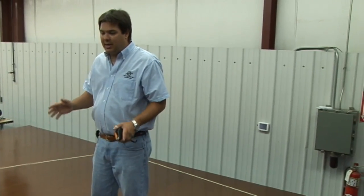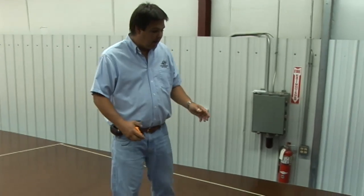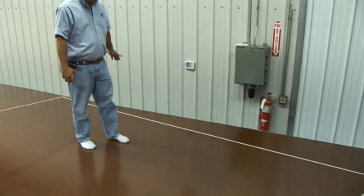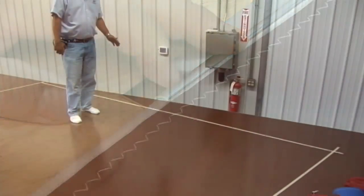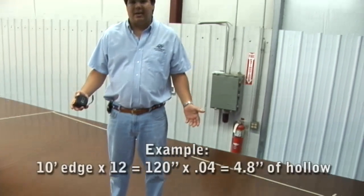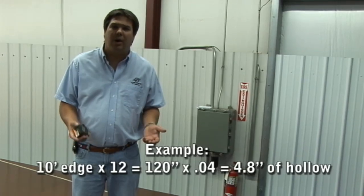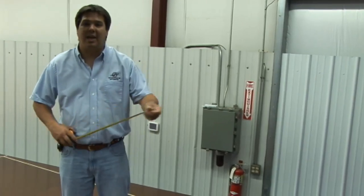Once you have the posts in the ground and you've figured out what size you want for the structure, the next thing is to figure out whether an edge needs a hollow to it, and how much hollow to put on that edge. For edges up against a straight structure that slide into a groove, you don't need to worry about hollows. But for the free edges, a good rule of thumb is to take the measurement in feet, multiply by 12 to get inches, and then multiply by 4 to 6 percent. That number will be the rough estimate for the amount of hollow you should have along the edge.